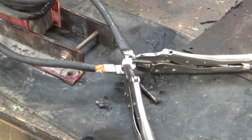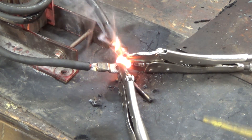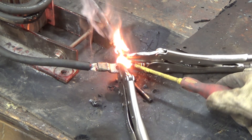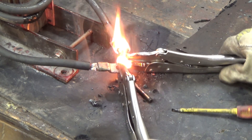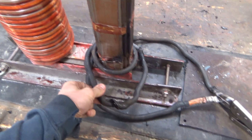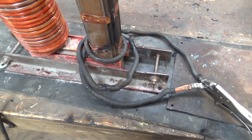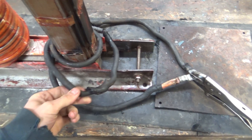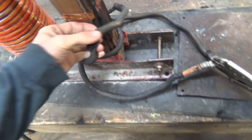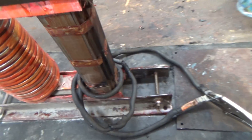We've upsized — she's now on a 60 amp circuit, still 120V. Is this illegal? Technically yes. You can see the dielectric grease from inside that connection just getting melted out. The limitation right now is our secondary: it's only 1/0 welding cable and we're melting the absolute crap out of it. We'll give her one more melt for you guys on camera to show just what I mean — you can see it deteriorating. Then I'll probably put like four parallel cables with three or four wraps into some termination gear.